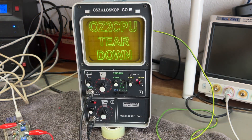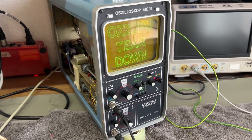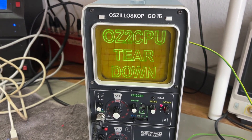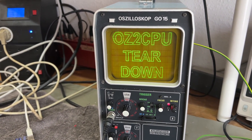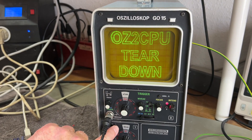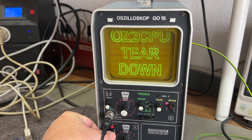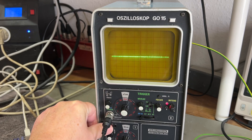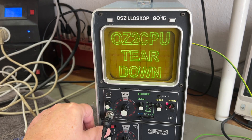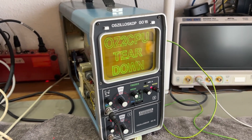I think I will call this the end of the video. Thank you very much for watching. What you see here is the XY mode — it is DC coupled, and this is why it's looking so nice and fine. The X is DC at the moment. I think I'm using AC couple for the Y — let's try and change. Yes, here we go. See, there's a little bit of DC offset. This will affect a little bit the picture quality. So thank you very much for watching — I hope to see you soon again.